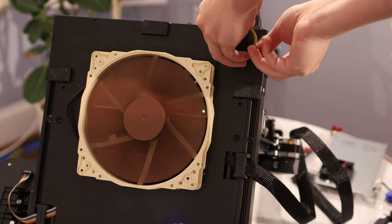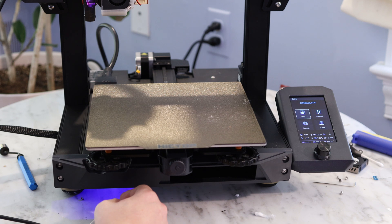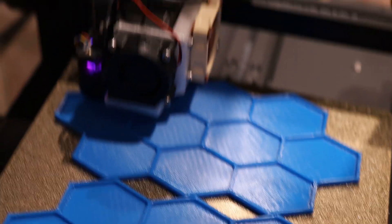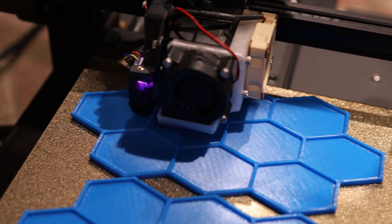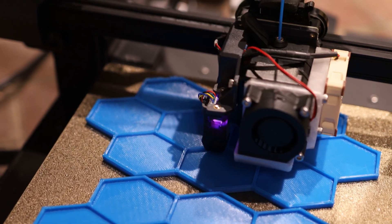I'm just going to put these squash ball feet on using a T-slot nut. The fan's spinning down there, so everything's working as intended. It's reading 38 to 39 decibels. It seems like most of the noise is coming from the X and Y axis stepper motors, so if I installed some stepper dampers I could get the noise of this machine down even more.